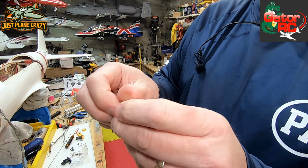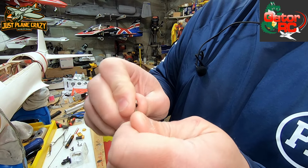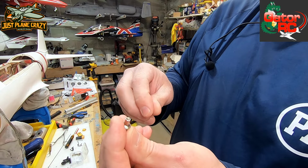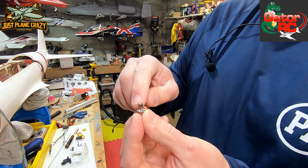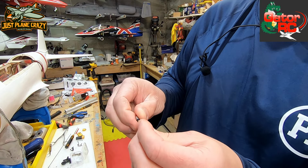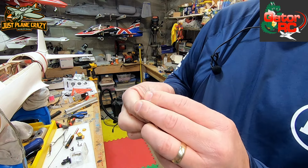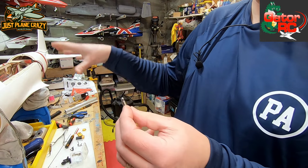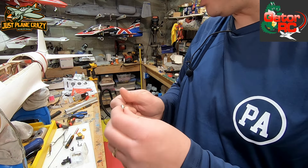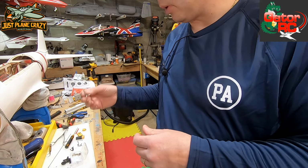What's neat about these valves, these are on the bottom. You're going to put this in the body, you're going to hook your fuel line up to it, and then that's your vent. So when you go ahead and fill these things, you can actually catch the fuel coming out. Some fields have an issue with any gas hitting the ground, which isn't great for the environment. But anyway, to fully seal off your fuel system or prevent any goop or drainage or leaks or anything else like that, you can simply just put that back in and the system is more or less sealed back up, short of what's open in the carburetor, I guess. But I like those things. A little cheap gadget to put on the plane. Very inexpensive, and they work real nice.